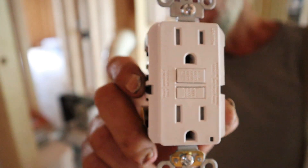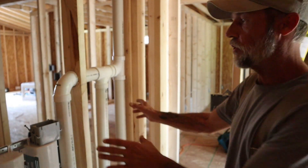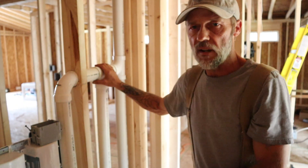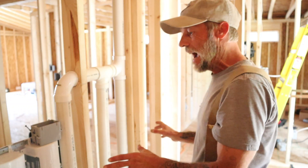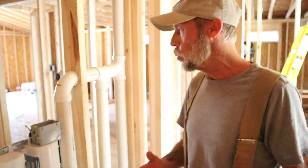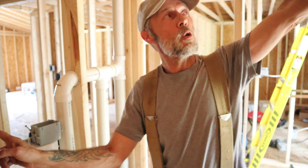This right here is a 15-amp GFCI — I won't be using this in the master bathroom, that'll be a 20-amp service, but this is just a little half bath. Here's the back side of the wall with our utility room — the laundry is over here in this room as well as our venting. I want to put a vanity right here and have an outlet, and it's going to have to be a GFCI. Because there's not going to be any tub or shower in here and moisture won't be as high as in a master bath, we're running 15-amp circuit. I want to put an outlet right here on this wall and run a home run 15-amp 14-2 wire over to the panel — all the wires need to be ready at the panel when the electrician comes in so he's not fighting and waiting while I'm paying for labor.